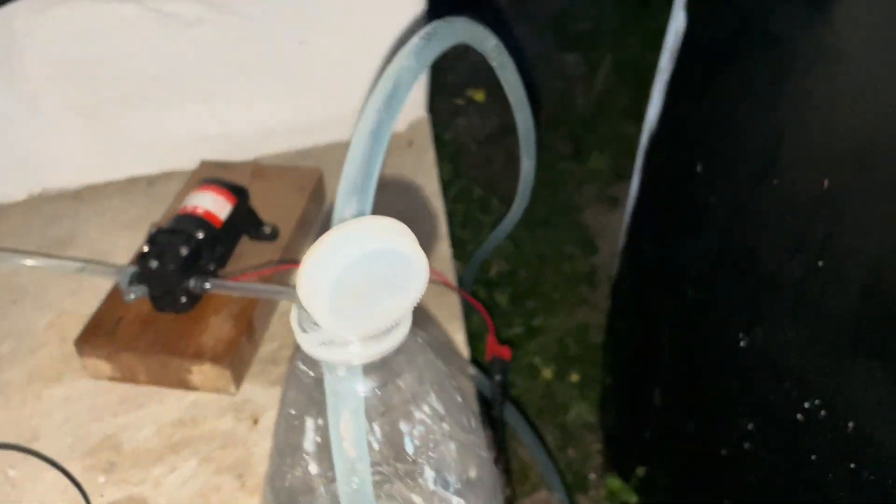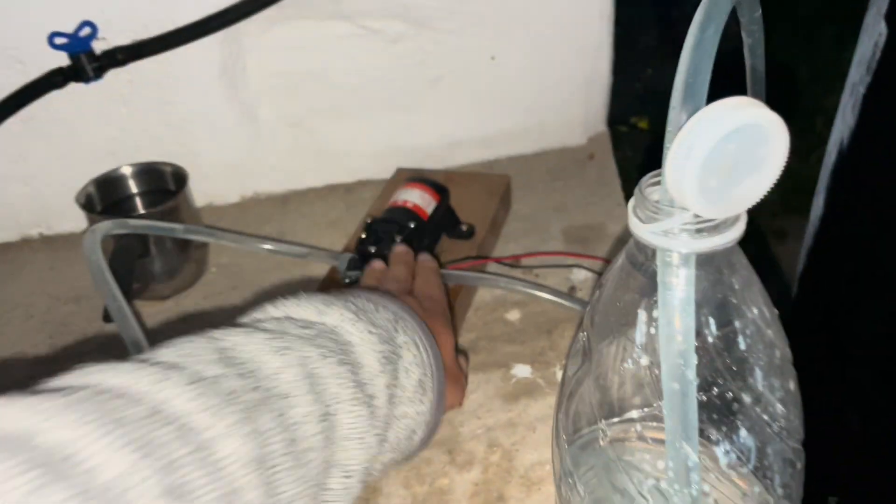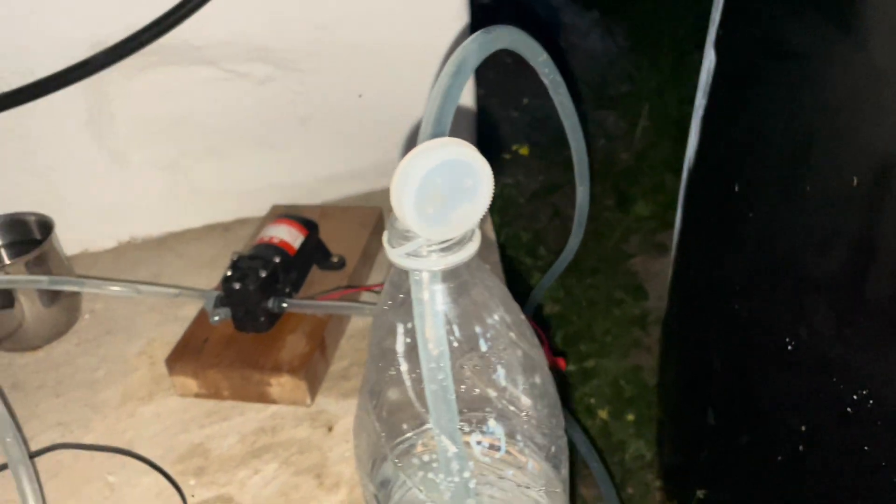I came back down. I think the issue was the pump priming. It says it's auto priming, however the auto priming is a little bit weak. But as long as it's completely primed every time, it works and brings water all the way to the top. When this tube is connected to the tank, it's going to be at the same level, so the water will always be here. As long as the tank is more than a third full, that won't be a problem. And even when it's less, it'll already be primed from before.